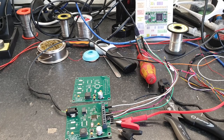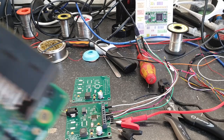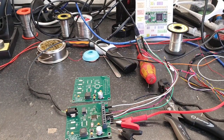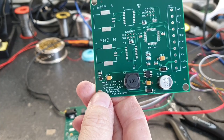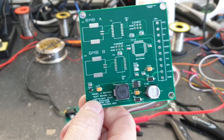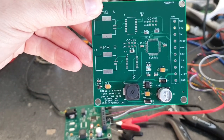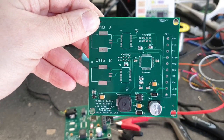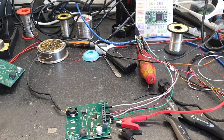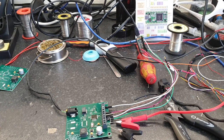So, what's the next step? It wouldn't have been much fun if every time we wanted to make one of these cards we needed one of these things to extract Batman from. So I did two things. First thing, I revised my circuit and made a version 2 of my little Batman board. And I had JLCPCB populate some of the components on there — a little 5V power supply, a little 3.3V power supply, some decoupler caps, and some load resistors for the ISO SPI. Then I thought: what if the Batman that is on the high voltage controller is the same as the Batman that is on the slave boards — or BMBs, as they're called in Model 3 parlance?